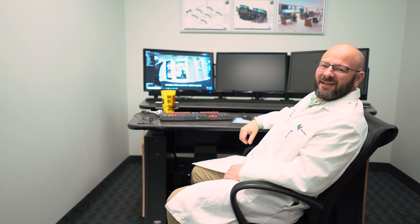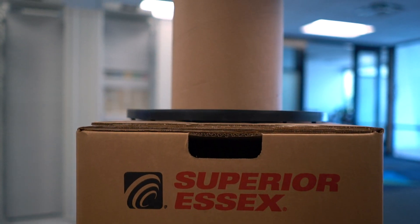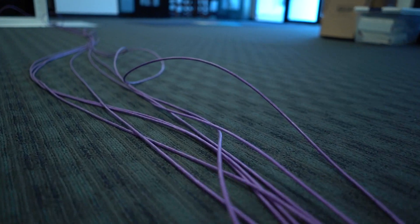We're just doing a little bit of testing today on some interesting cable from Superior Essex. It's called PowerWise. On their spec sheet, they claim that we can run PoE and data 850 feet. So, of course, to take it to the extreme, I ran a full 1,000-foot run and we're getting some pretty good results. Come check it out!